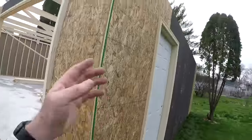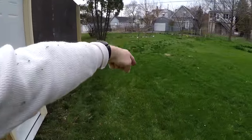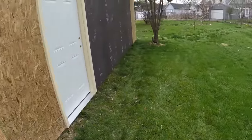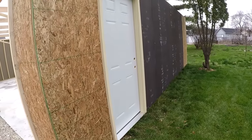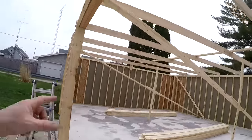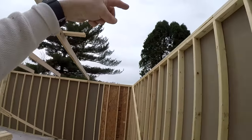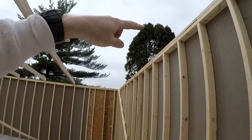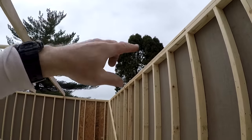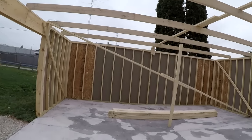Bad time. I'm going to brace this wall straight, put a block in, and run down to a stake. That way I'll set my rafters coming from this end, and when I get my two sections of ridge up, I can get my angle brace in at this end and it'll be true, and that'll hold until the sheathing goes on the roof.